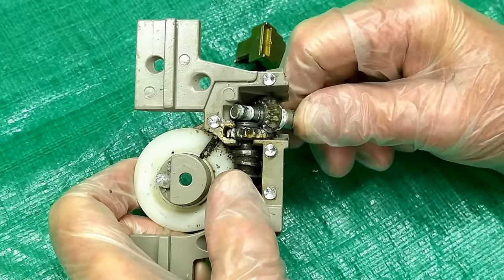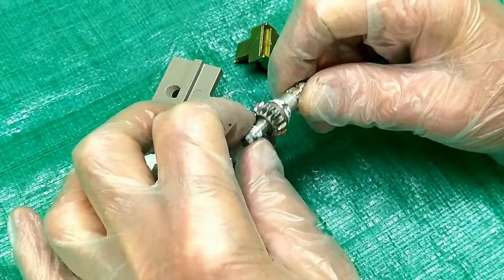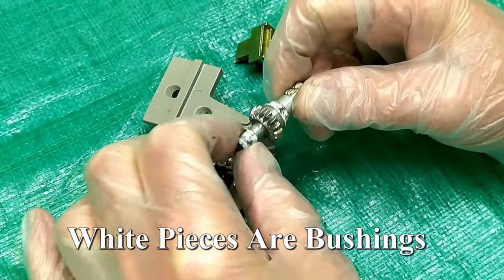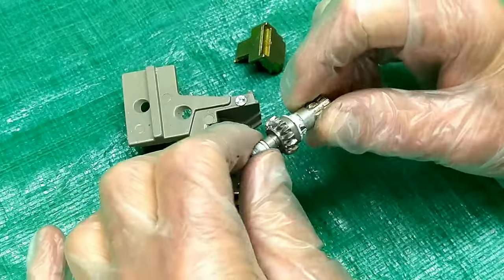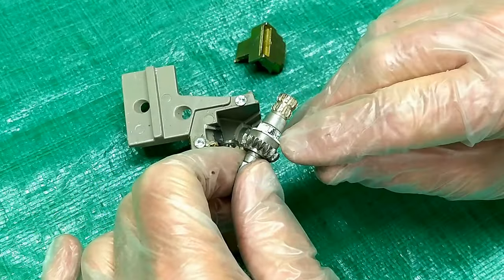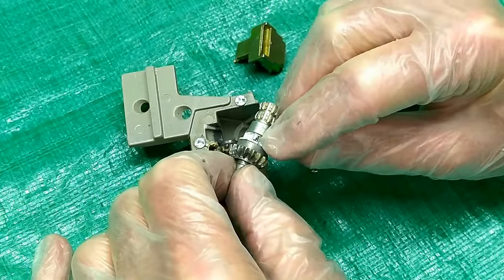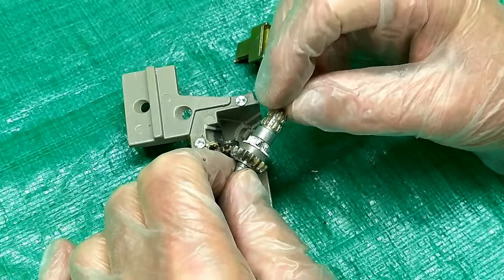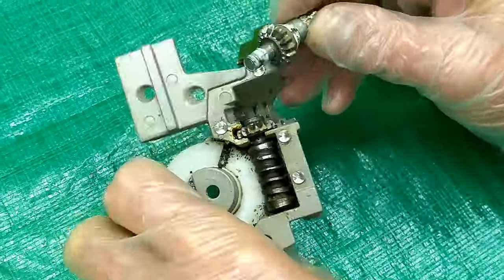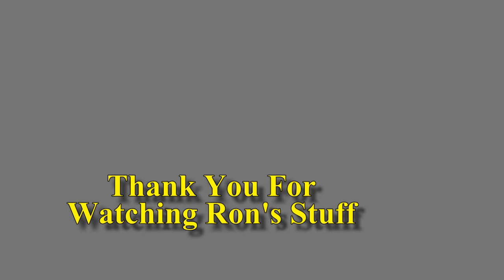I can see where this has quite a bit of wear right in here. Interesting to note that this top plastic piece does rotate to some extent. This bottom plastic hex-shaped piece is in better condition. Looking at how this is made now, I would say this is probably machined or cast in one piece. These nuts are both split — they expand and just slide in there. It has a hint of white grease in it, but looking at these teeth, it's a good idea to replace this.